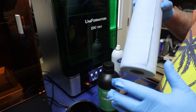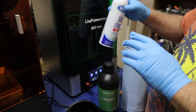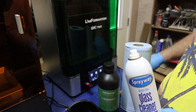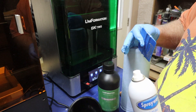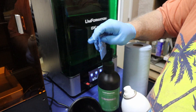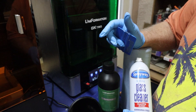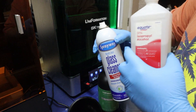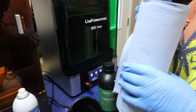When I clean up resin, I only use blue shop towels — they're not harsh and don't scratch like a paper towel. I always use Spray Away glass cleaner; it will dissolve resin. When cleaning up the vat, I'll use a funnel with a filter to pour resin back into the bottle, making sure no debris gets back in. I use a soft silicone scraper to scrape out the vat, then spray with Spray Away and wipe with a blue shop towel. If you don't have that, IPA — isopropyl alcohol — will work.